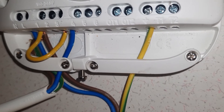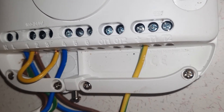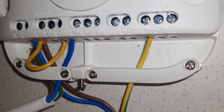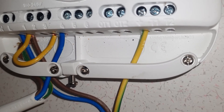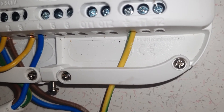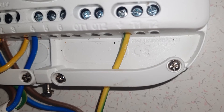Ports 4, 5, and 6 are for if you have a separate hot water tank — you can link the hot water to those. Mine's a combi boiler so I don't use them. OT1 and OT2 are for OpenTherm boilers — more modern boilers that use OpenTherm, which is some kind of eco mode. The earth symbol is the earth cable, also running direct from the boiler. T1 and T2 are if you want to permanently wire your Nest thermostat — if you've already got a thermostat wired on the wall, you can wire it from T1 and T2 into the Nest thermostat.